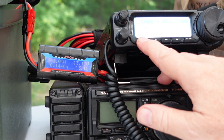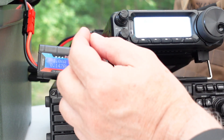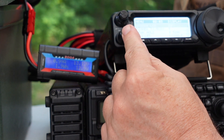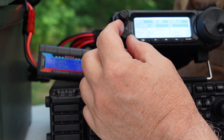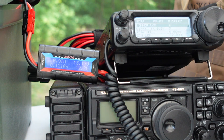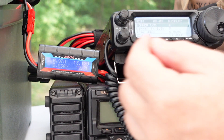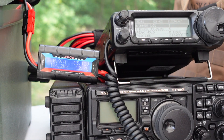I'm going to press and hold the function key. The menu selection I've got selected here is the dimmer LCD. I'm going to push and hold the multi-function knob — now that highlights the dimmer LCD. It's set to 15, which is the maximum. If I take that down significantly, you'll notice you can start to see the display, because the camera likes the lessened contrast a whole lot better. And you'll see that we've dropped down to 0.97 amps. I'll turn it off — still at 0.97 amps.